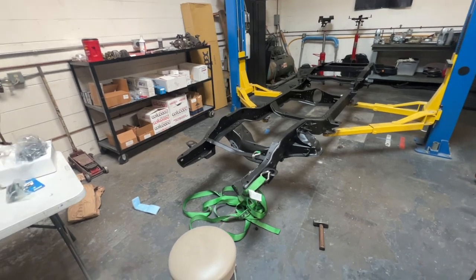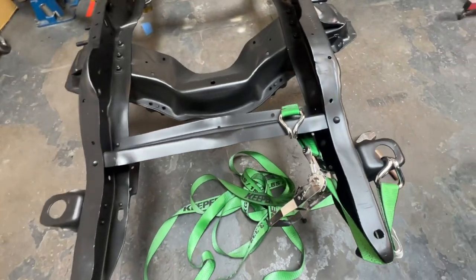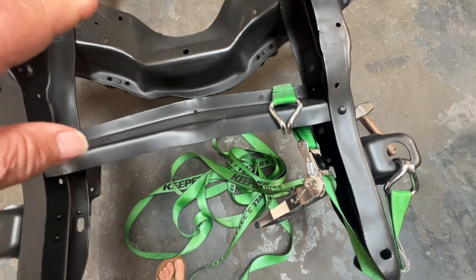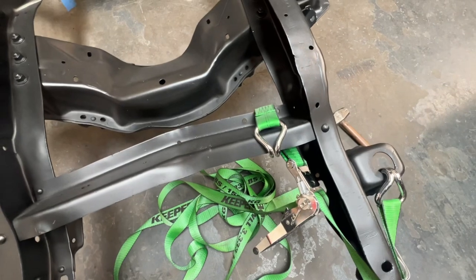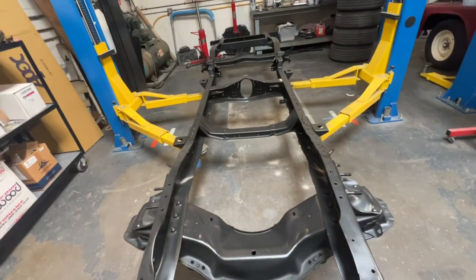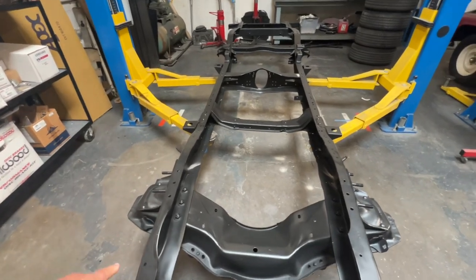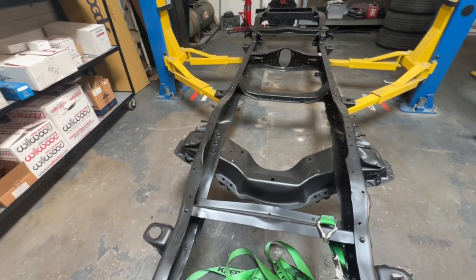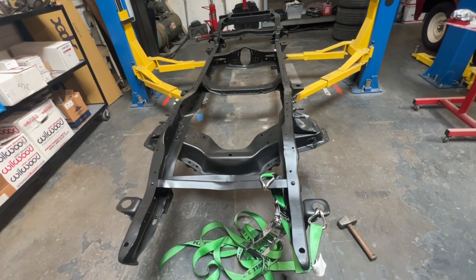I'm finding all kinds of sketchy stuff about this. The front reinforcement hot rivet had sheared off, or maybe they hit something and it was twisted out of the way. I put a ratchet strap on it and ratcheted it back where it's supposed to be because it was way out of alignment. I've measured the frame — a lot of these holes are references, you triangulate them — and it's not damaged, but it definitely took a hit.